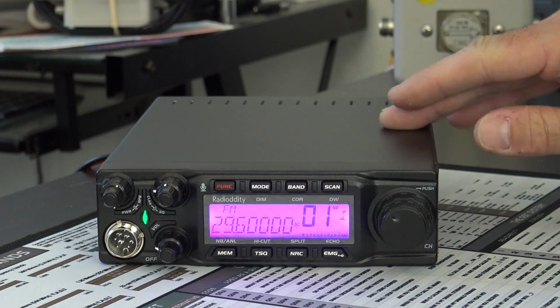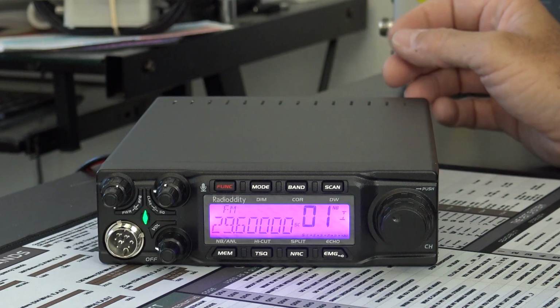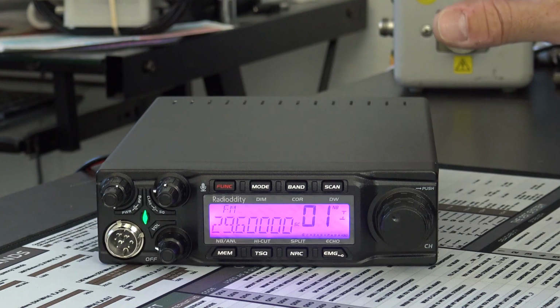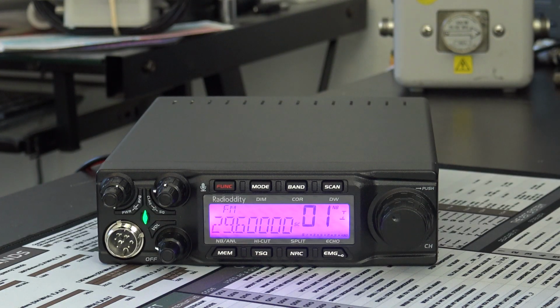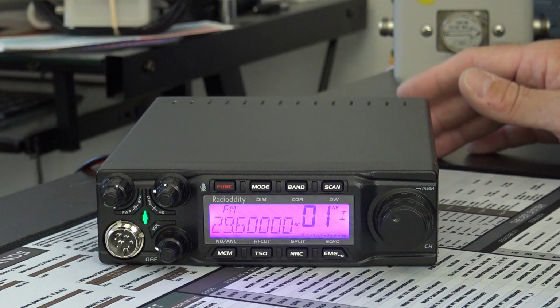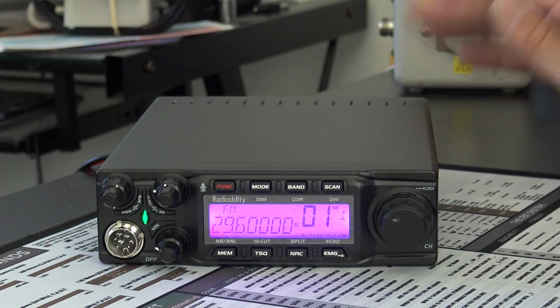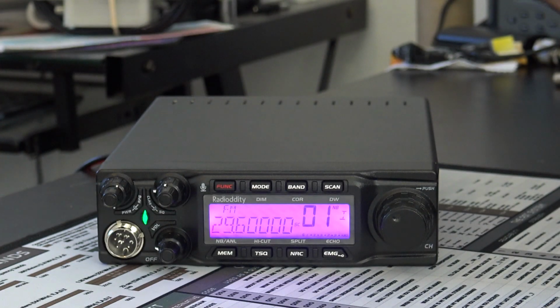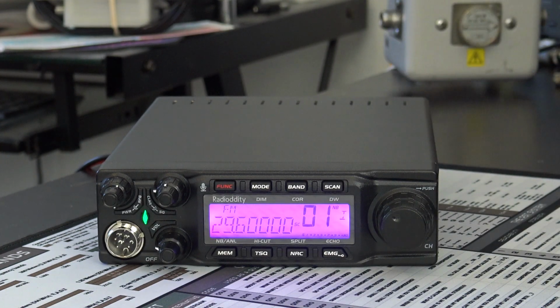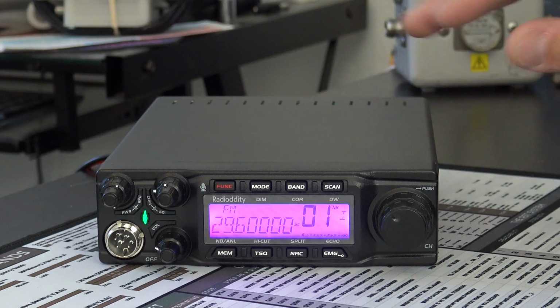It's sold as a 10-meter. The modification is not told by Radioddity or whatever. It's there, okay? But I got about 72 watts. I don't have PEP on this meter here. The FM is rated at 50 watts, and I got about 38 to 40. So I want to use something better than this Bird, although this has been calibrated, it was due in 2022. So maybe this and the slugs are out of calibration. We're not sure. But this thing is cool, okay?